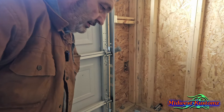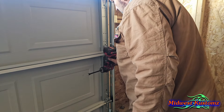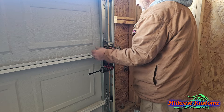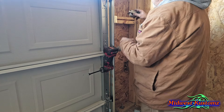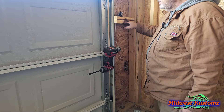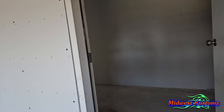Down here I get my regular bolt — not a self-tapper — put it on there and hook it to my drill. Then I get my top plate and hook it in, just sliding it down on top of my drill. If I don't have that right there, sometimes you'll have a two-by-four to your right to rest it on. Before I put this top panel up, I always open the back door to get some light coming through so it doesn't get too dark.